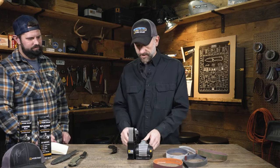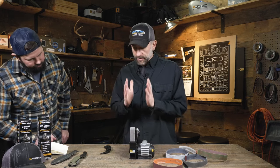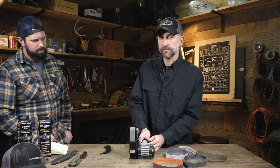I'm going to get myself set up here. Tracking right here on the side. So when I spool up the machine, I can just quickly track here, get my belt perfectly centered, then I'm ready to go. I'll also set the speed when I do that, to get that low speed we were talking about earlier.